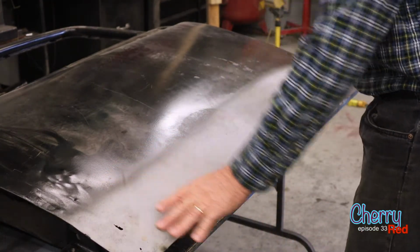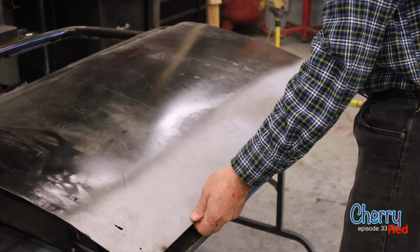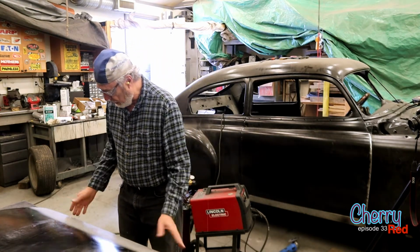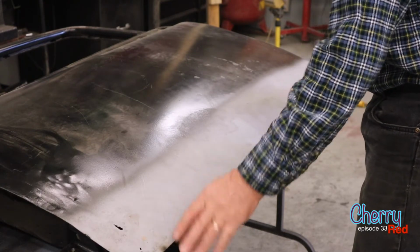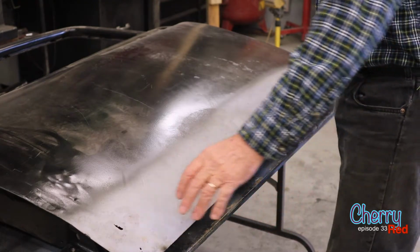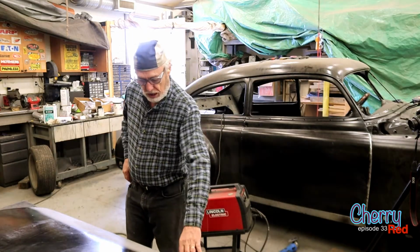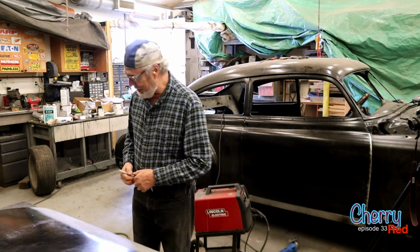We'll patch this straight part, the easy part, first, both the bottom of the frame and the outside panel of the door. Then when we have that reference to the corners, it'll be exactly the same as the old one, because it'll just reference to these corners. Then you can take the corners out and rebuild those in reference to the new part that you've put in. So you don't want to just cut the whole thing off and then not know where you are.